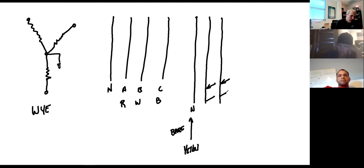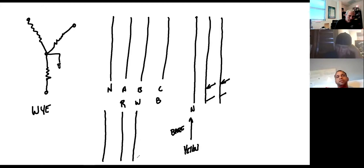What about the electrician side? Is there anything that will identify, I'll put three conductors over here for 120, 240. What do they do? They use another color code. Well, typically, and Professor V, jump in for your historical perspective, you're going to have two hot wires, and an electrician is going to use an insulated wire for the neutral. He's going to put a white piece of tape around it. Professor V, have you seen things that have been different? No. The neutral's always been marked with white tape, the ground with green.